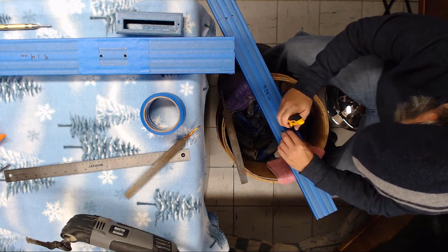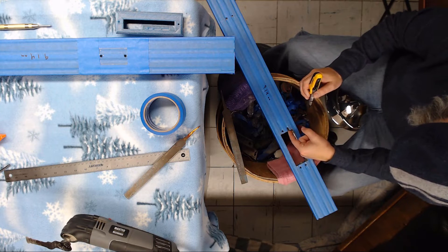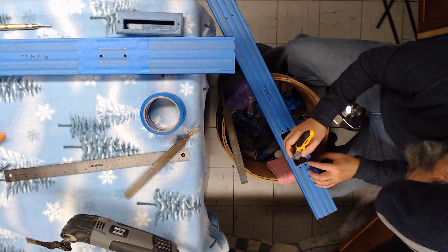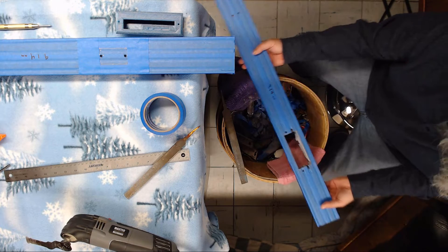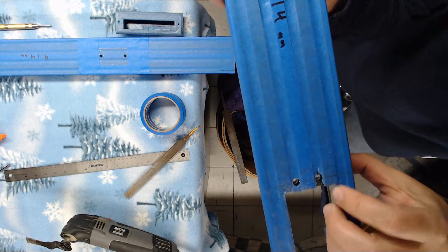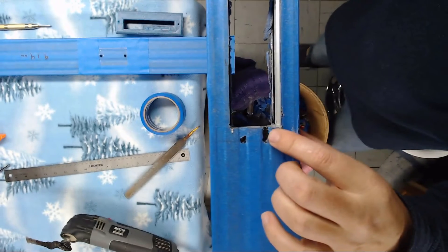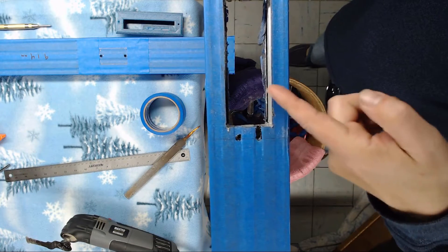I need to remove the tape so I can see what I'm doing here because we have to file down this groove right here for the slide tray to go in and engage into the 2040 extrusion. It's going to be bolted on the inside of this. So we're going to file all the way back to about an eighth of an inch from that hole — just a small little strip on this side and a small little strip on this side between the hole and the notch.